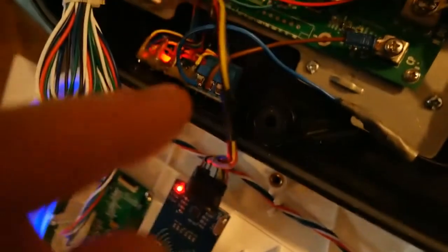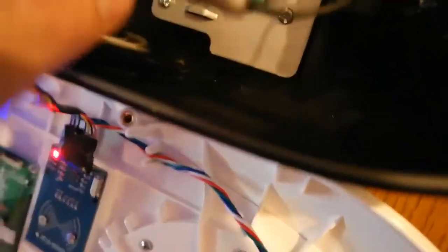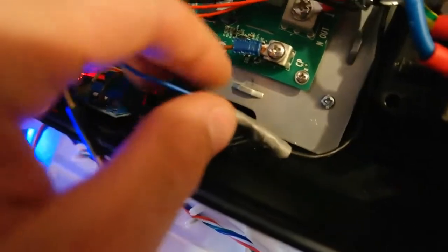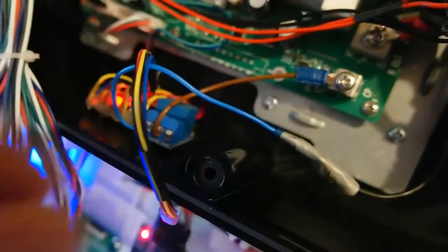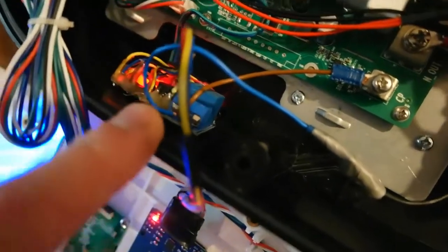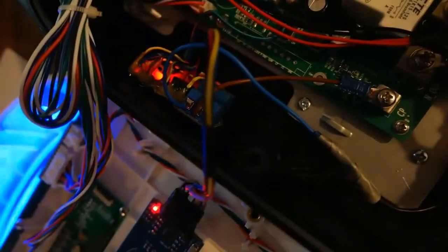You don't need to modify anything on the charging station except the pilot cable. You disconnect it from the mainboard or controller in your charging station, connect it to the relay, and then the relay is connected to the charger pilot signal contact. Essentially it opens the contacts, so until you swipe the card there is nothing connected and no charging is possible.